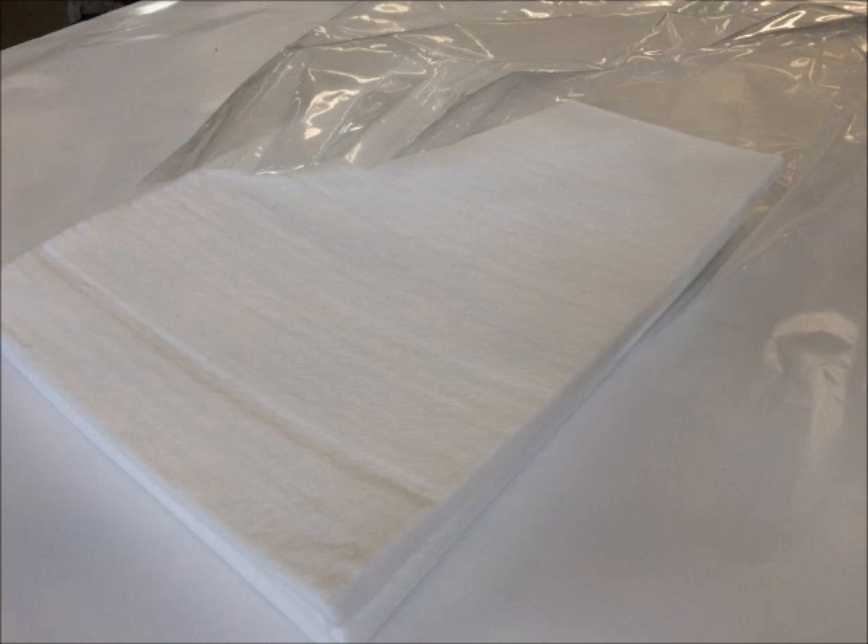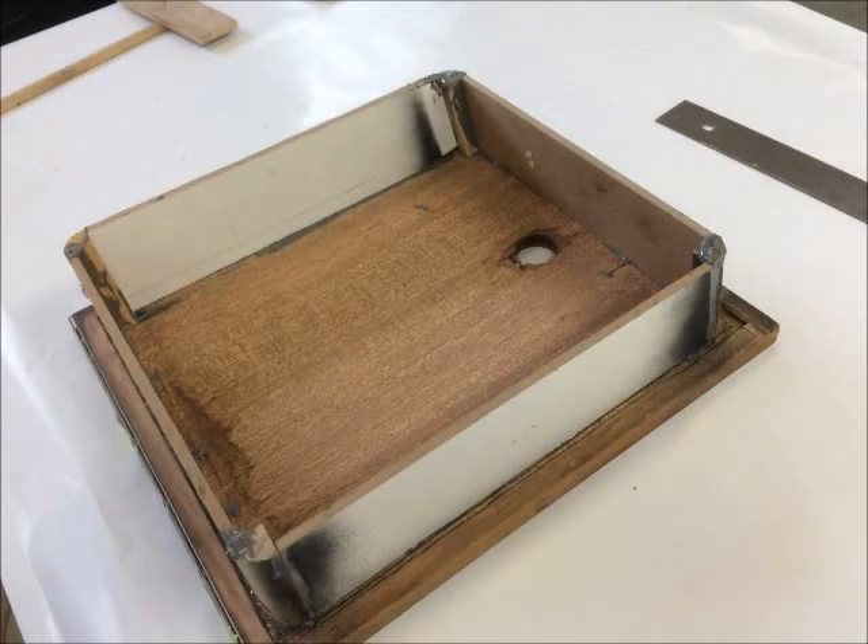We built our new enclosure to attach to the old door lid. We cut out four sides of thin particle board and used a quick-set epoxy to glue them slowly and carefully, piece by piece, to the lid, making sure it was level and square to fit the opening. Because our lid has rounded corners, we used pine quarter-round mouldings for the corners.